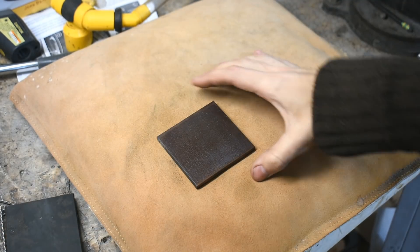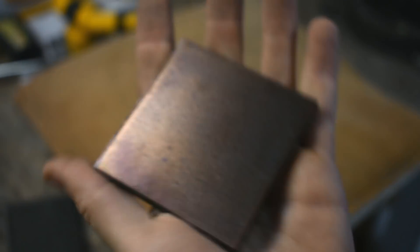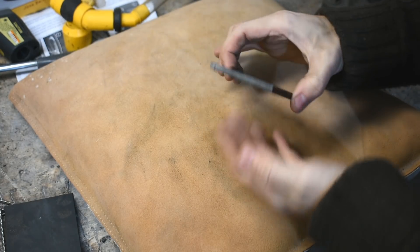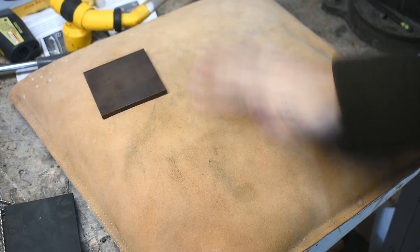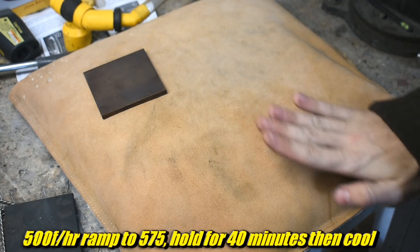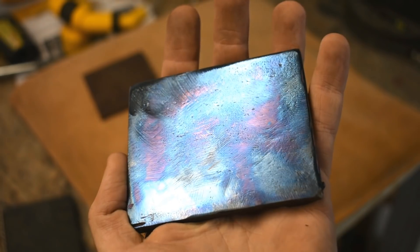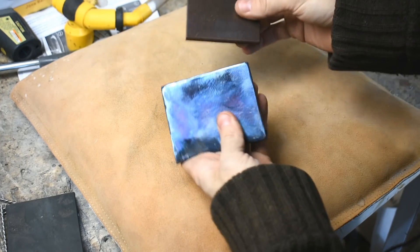I came up with this. It's certainly a different color, but I was going for blue and it's kind of that straw-purple boundary. So that didn't work. I figured the temperature was right — I just maybe didn't hold it long enough. It maybe heated up too quick, and the metal didn't have time to catch up because it's kind of big. So I took another piece, cleaned it up, threw it in for a longer period of time with a slower ramp rate. And I came up with kind of bluish and purplish — I really didn't clean it very well, I can still see the grinder scrapes. Heat blue. So we got the high temperature test done with the cone curling over, and we got the lower temperature with the heat bluing. It works.